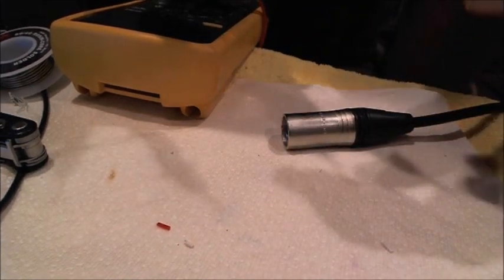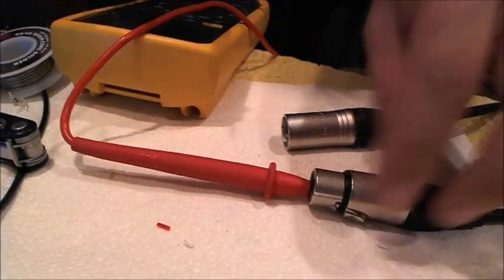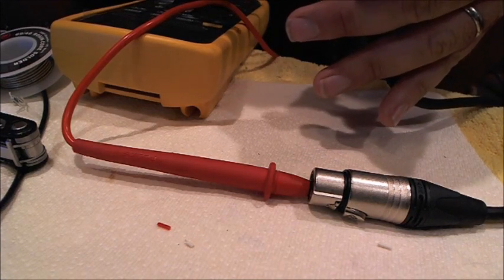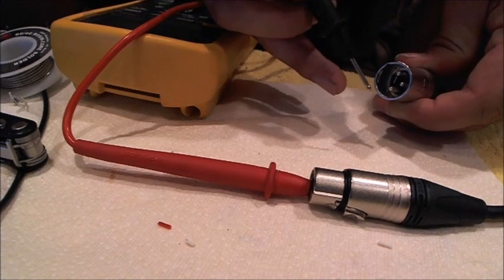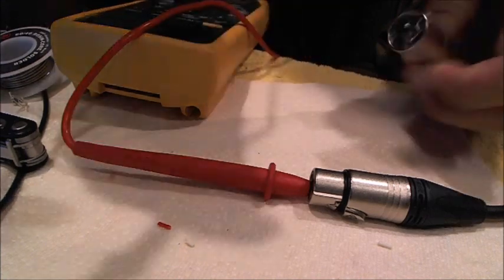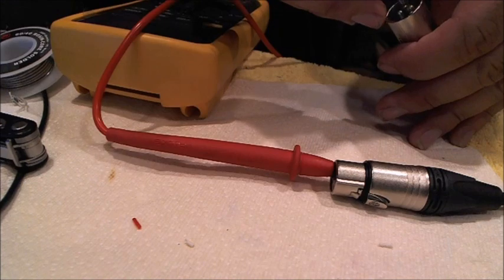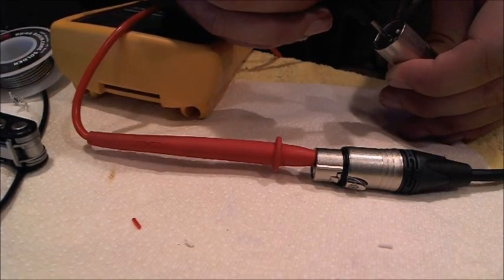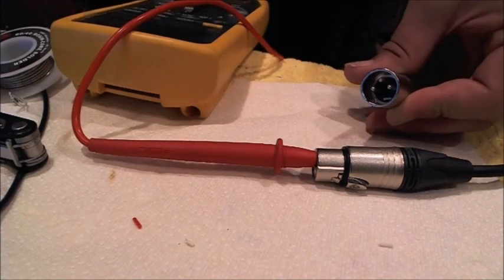continuity test function on it, and you can just pick a number lug that's number one in the female side and find pin number one on, there we are, and it does not light up number two or number three. I'm touching pin number one. Yay, it works. Let's try number three in the middle. Yep, and neither of the other two work, so that's good. And number two, right there. Ta-da. Double check that I got it right. I did. Ta-da. There you go.